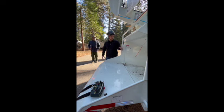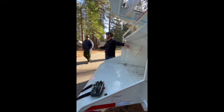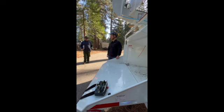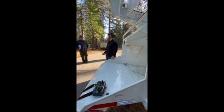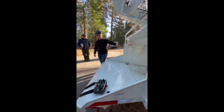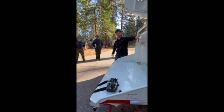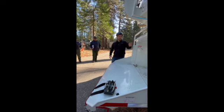On that knife, since that's running through my mind, guys, please do not use a die grinder to try and resurface those knives. We've seen it done before. You just bought yourself new knives, so don't do that. Bandit does sell a little resharpen tool. We take them home and use them for our kitchen knives, because that's really about what they're good for. Unless they're brand new like this, to where there's still a real sharp edge on it, it's a useless tool. A lot of guys think they can let their knives get rounded over like this and then use that little tool to resharpen their knife.